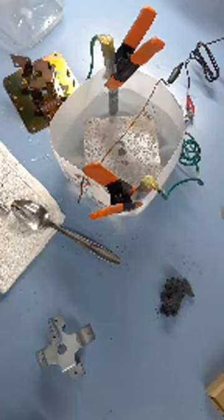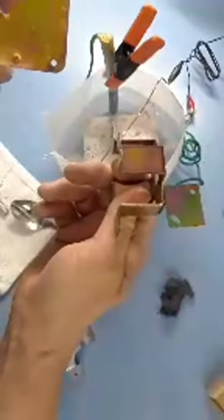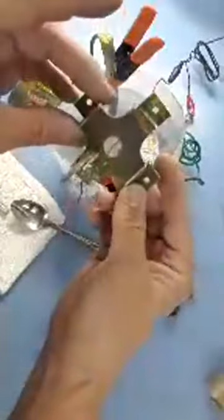There's a company called Caswell Plating — they make the chromium dips, which I have on order. I sent these all out to a company in Salt Lake City called Quality Plating. They clean the parts, zinc coat them, spot weld the holder on, and then dip them in a yellow chromate. I don't know how long they dip for to achieve this color, but I think it's really beautiful.